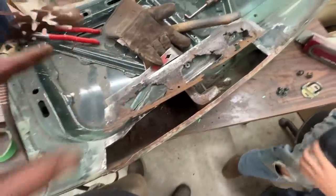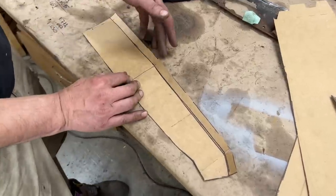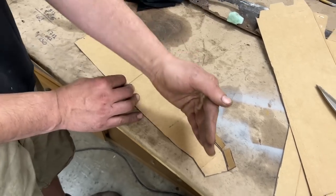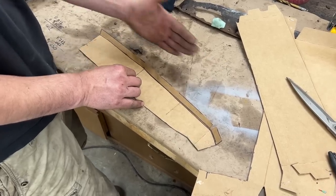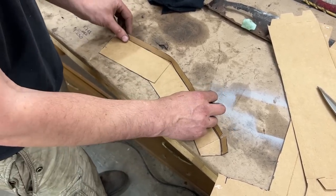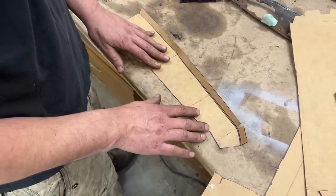This patch turned out to be a little bit more complicated than I expected, so Nicola needs help with it. The patch in final shape needs to be like that - it needs to have this flange up, but this flange is a little bit curved, which means we can't do it on the brake because it goes and has a little bit of a bow on it. If we make a straight flange first and we shrink here, this flange is gonna become curved, but we can't shrink that deep.